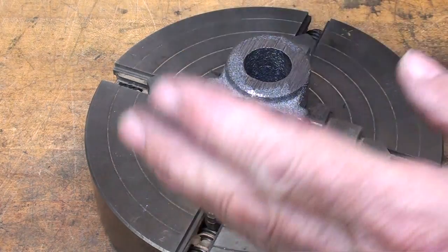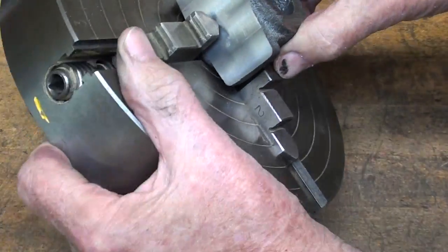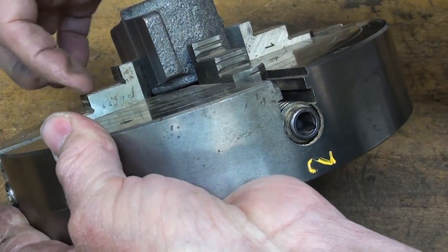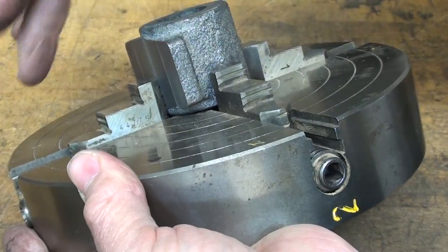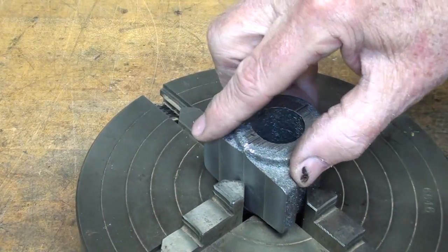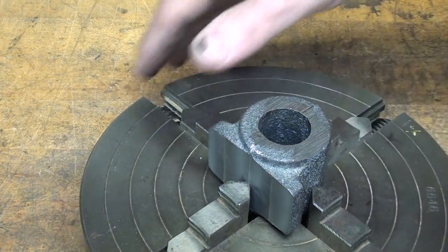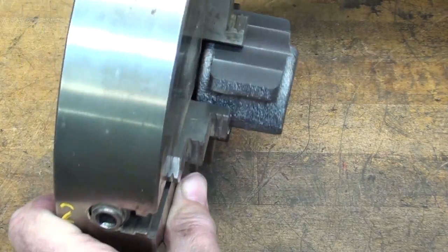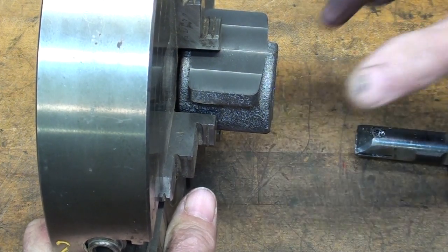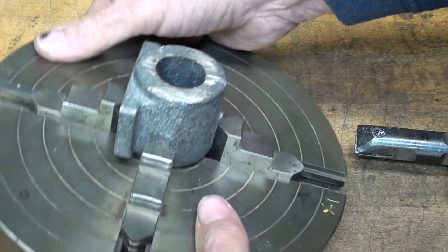Here's a suggestion — it certainly can be held in a four-jaw chuck, that's a wonderful way to do it. But now with the bottom of the casting machined off, we have a basis for holding it with the jaw up against that. It would be nicer to do this on a larger lathe with longer jaws, but this is off the Atlas lathe, and it's a difficult setup to get it centered compared to doing it on the Bridgeport. So that's why I prefer the Bridgeport with the Criterion boring head. On the lathe you'd be doing it like this and you'd have great control over boring, but you'd have to keep it away from the back of the chuck so you don't run the boring bar into it.